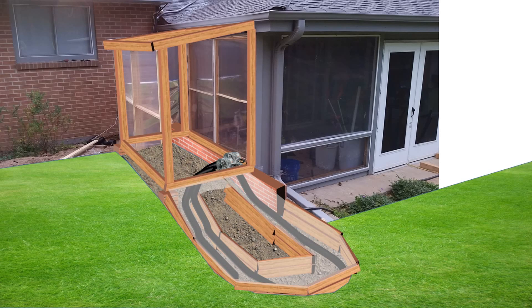The next step is to cover the channels with plastic. I use greenhouse plastic since I've got scrap lumber lining the sides of the air channel, and I can just staple it down with a staple gun. Once that's done, I can also cover the plastic sheeting with styrofoam insulation to really make it well-insulated — it does get very cold here in Colorado.